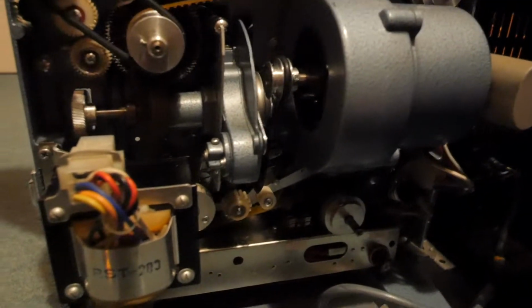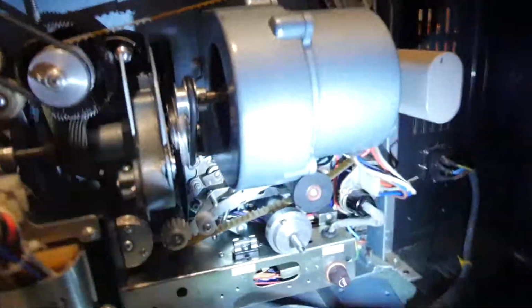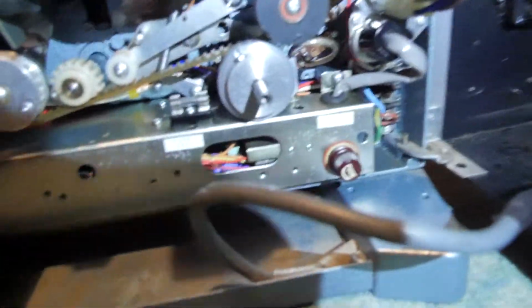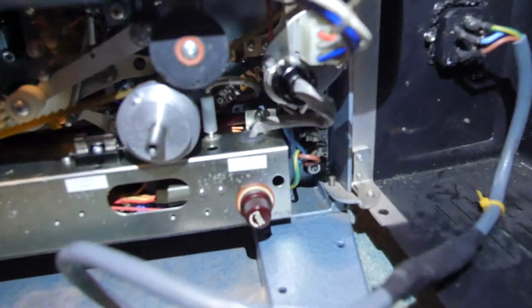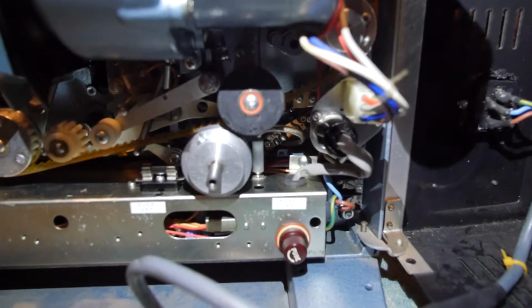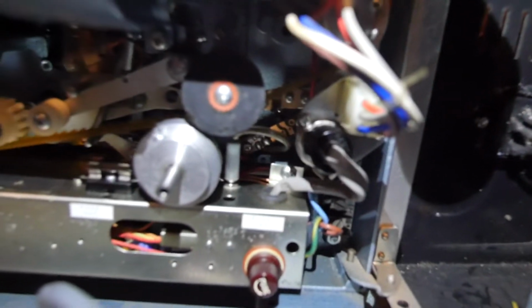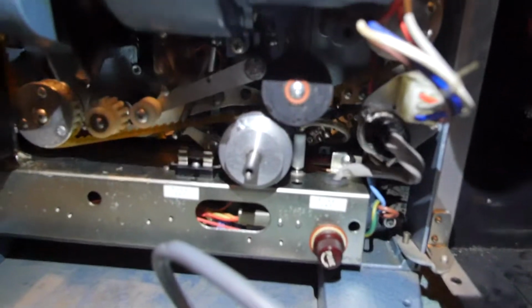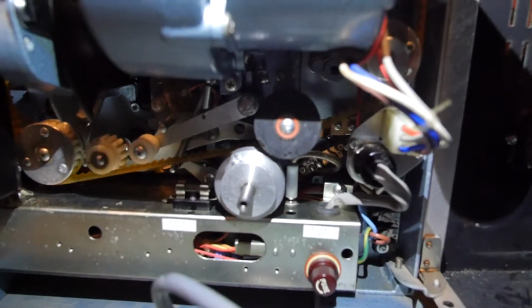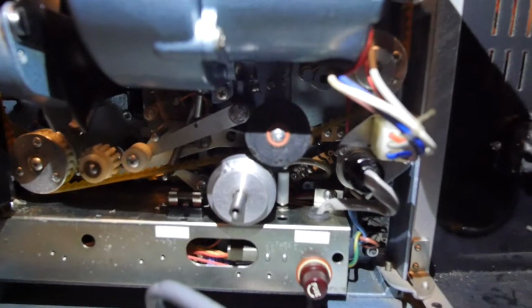What I did try to do was take the sound directly off the pickup into the line in or microphone. So looking there, that little grey connector, the 3.5mm one in the middle of the picture, I tried connecting that directly to the microphone and line in, but the signal was just so extremely weak, the computer could hardly pick it up.